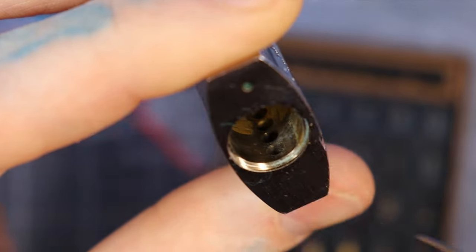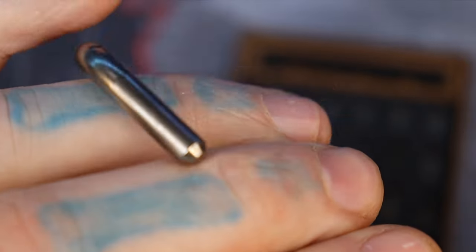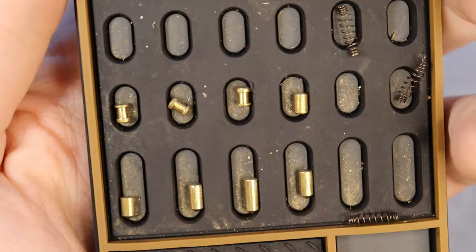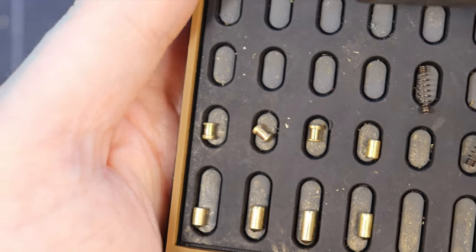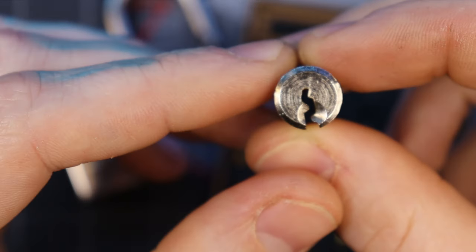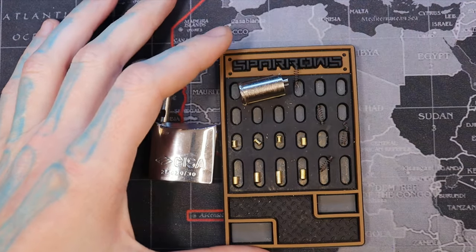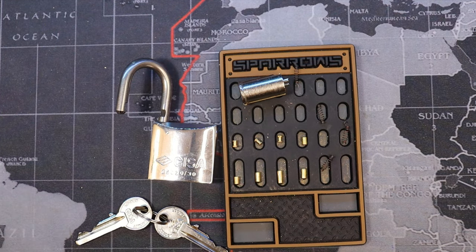Here are the holes for our pins - four pins right there. Here are all the pins. This does have spools like I suspected, definitely felt them. Three spools, one standard, four pins. The CXA - again, surprising. If you see one, pick one up. It's worth getting just to have something slightly different that has some spools and security pins in it. Here is our CXA 26020, 30 millimeter, completely gutted. Just small keyways, small lock, and some spool pins. Alright everyone, thanks for watching.